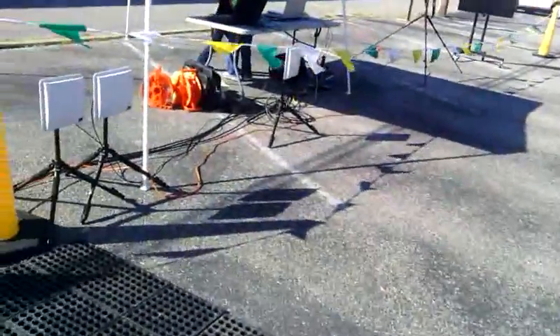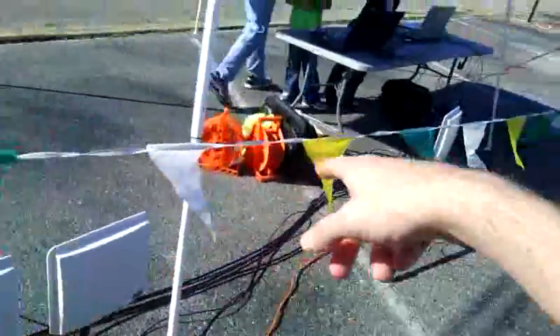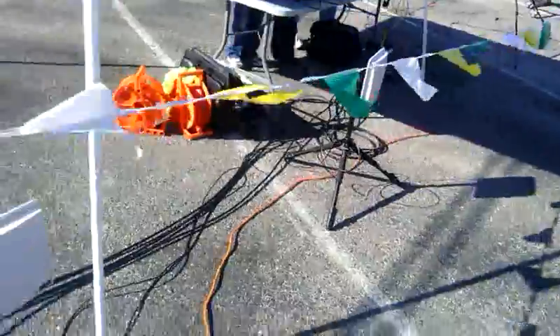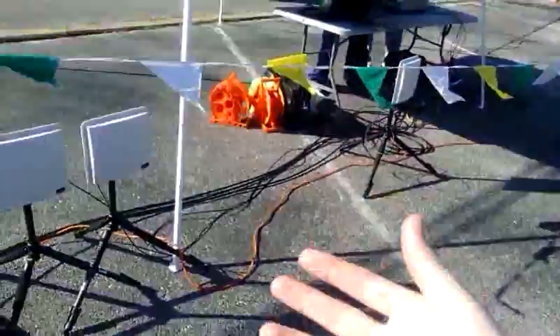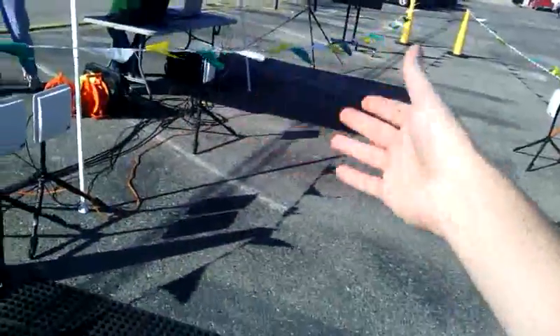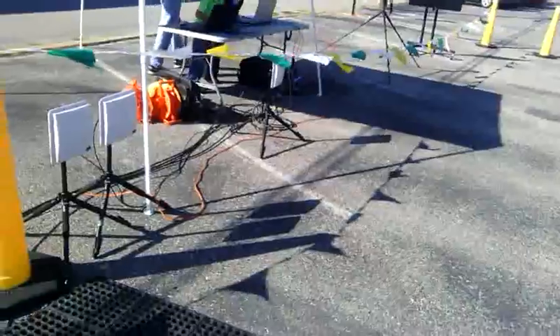We put the first two antennas connected to the 9500. The second antenna here is connected to our backup reader, the TR200. If our main reader were to go down, the primary antennas would die, but we'd still have this one, which reads about 6 feet, picking up everybody. If we noticed our main reader went down, we'd narrow the finish line a bit and make that antenna easy to pick up all 6 feet, then work on getting the main reader back up. Luckily that hardly ever happens, but as a professional you want to have as many backups in place as possible.